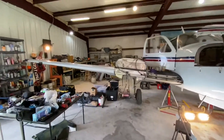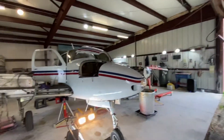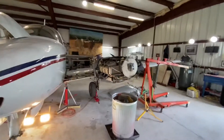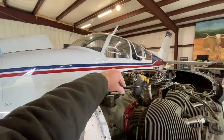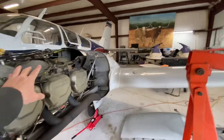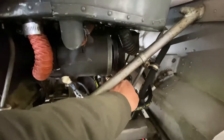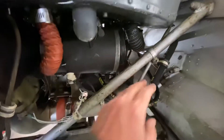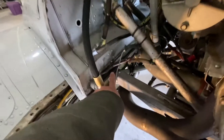What we have here is the plane back inside from where we were parked down at the end, and I'm commissioning Al to remove and replace the left engine throttle cable — this long shaft going up and down, connected to the white pipe — the mixture and throttle cable has to come out through here, and then the cable gets fed out.